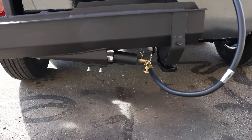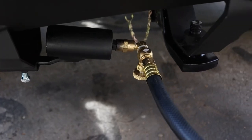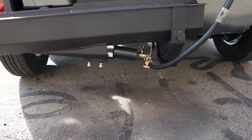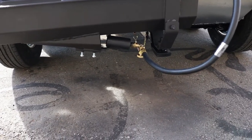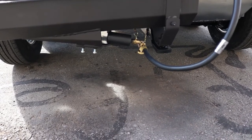Under the chute, you'll see that there's a single 80,000 BTU propane burner. It has a needle valve underneath the hose here that'll control the flow. You'll definitely want to have this on before dispensing your material to get the chute nice and hot so that the material continues down and gets to the ground before it starts to solidify.